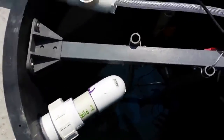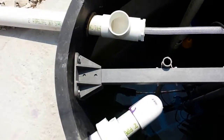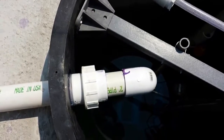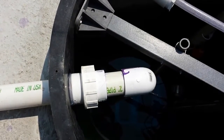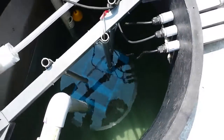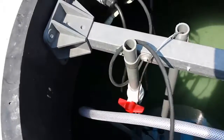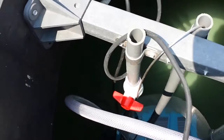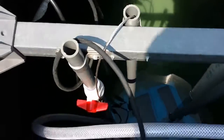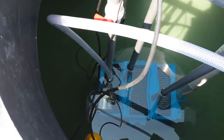In order to be able to pull this out, we have Biomicrobics containment system, which is a unistrut cutout, and we have the union for the air in a horizontal position, not vertical. The pump and the clean in place line have to be kept solid, so it doesn't move around, and so we attach it to the same bar as the hold down pipes. Also, at the bottom, you can't see it, but there's a cord grip.